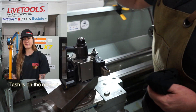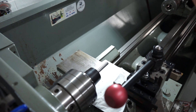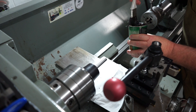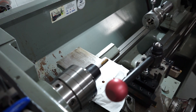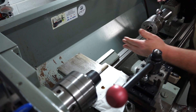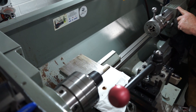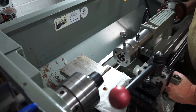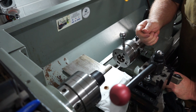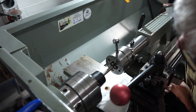So I'll get Tash to shoot over the top here in a minute. And here's my Coventry die head. Put a little bit of oil on. So I'll show you that again. I've got it set ready to go. Slide it up. Now when I'm doing this I'll lock the tailstock and I'll wind this in — I'll hand feed it. I'll stop at five turns and it'll take roughly another turn to disengage the Coventry die head. So I'll bring this up close.